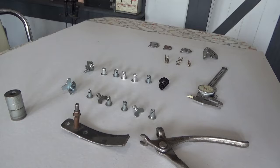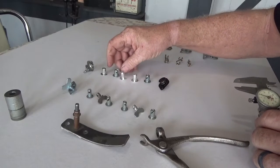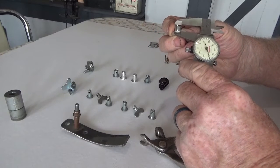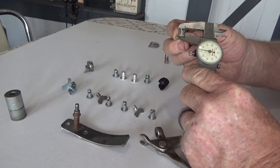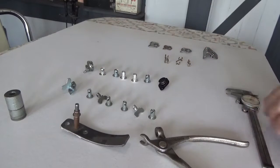The next thing you're looking for on a fastener is the length. When you measure a fastener, you measure from the head of the fastener to the ending slot. This one here, if you measure it right, measures .500, which is a half inch. Typically you can get them through some of the mail order catalogs: .450, .500, .550, .600, .650.